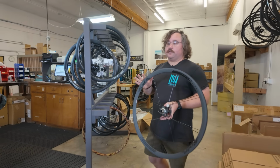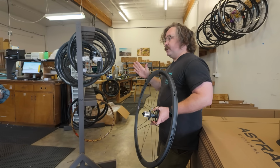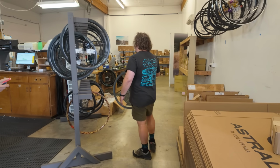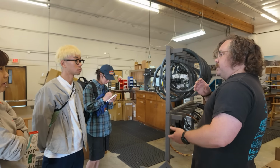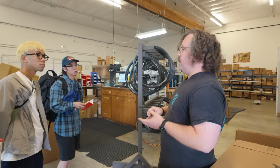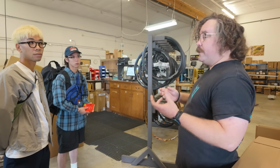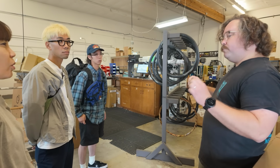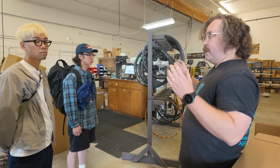Cerakote stuff. And actually, right now we're in the process. Most of the Outback and Outback Wanderlust Highlight and Highlight 25 rims are all going to be black Cerakote now. We found that Cerakote is better than an anodization because it's better for corrosion resistance. So it's more durable. And since you're not anodizing it, anodizing actually makes a rim a little bit more brittle. It makes it harder, but more likely to crack. Whereas a raw rim that has been Cerakoted has a much longer fatigue life.